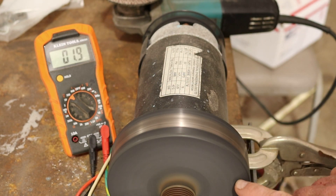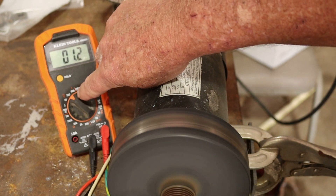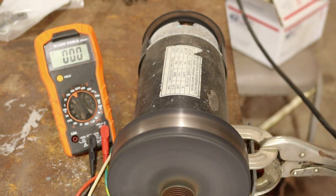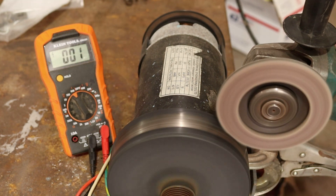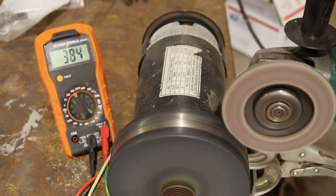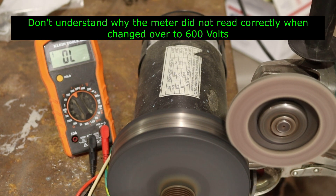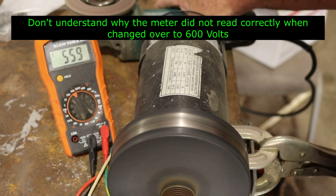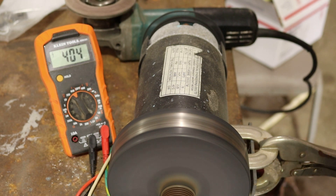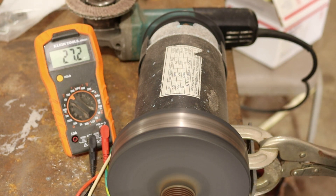You see it takes quite a bit — it's still spinning pretty fast. This thing was set at 200 on the meter; if I set it on 20 it will overload it. We can try 600 and see what it does — it's not going to really change much, just the way it reads out on the meter. Not sure why it went overload at 600; it should have been able to read with just different decimals. But it's sitting at 200 volts — we got 24, it's already slowed down considerably.